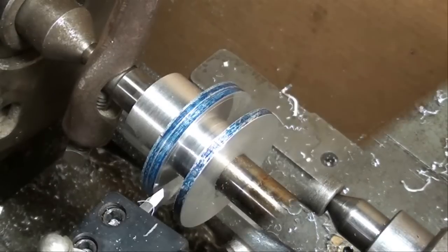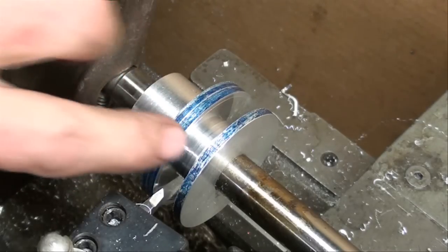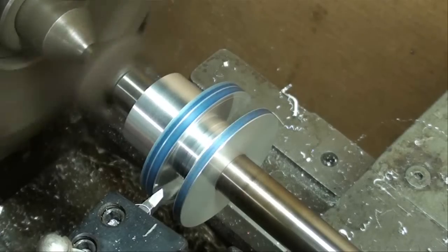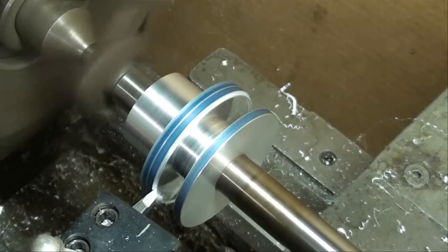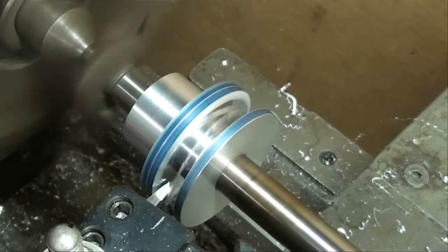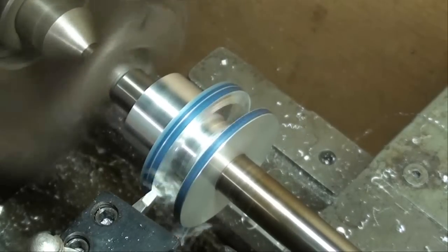The work is now reversed; the dog is on the other end of the mandrel and now we have access to machining the other side, which is still on the left, and we're going to machine it at 30 degrees in exactly the same manner that we did the other side. I'm advancing my carriage with my left hand after each pass, maybe 10 thousandths. I'm just guessing on that — advancing it with the carriage about 10 thousandths and feeding out.